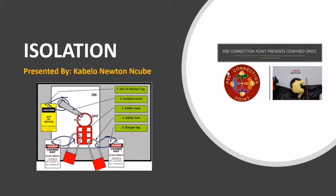So guys were working in a confined space, busy with rubber lining. Many people know that the product that is utilized is extremely flammable. The mechanical company was busy within the location, grinding, and a spark ignited the fumes coming from the top of the silo. I think 7 people were critically burnt. 5 of those guys later died, and 2 survived with serious burns.